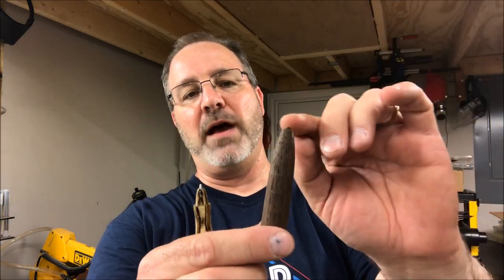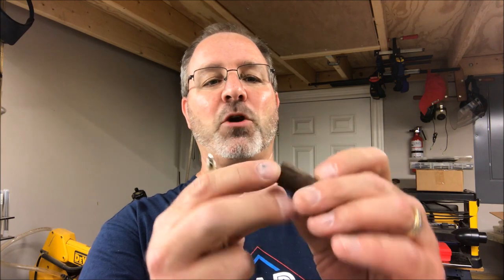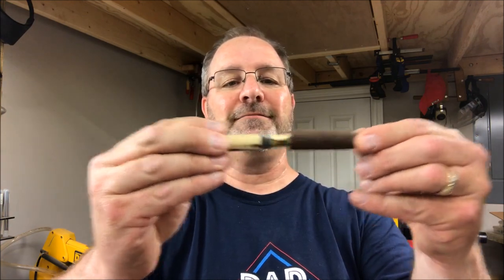Well, I had a great time in the shop today but I didn't quite accomplish what I set out to, so I'll be attempting this again at some point. Here's the cap I was working on — it's a little longer than I wanted. I had just parted the end off; you can see the nubbin on there. What happened is I had it on the mandrel and as I was parting it off, the parting tool bound between the cap and the piece I was removing. When it did, the cap stopped turning, the lathe kept turning, and it literally ripped the little acrylic inlay out of there. It was a very fine piece of acrylic I had put in as an inlay that allowed me to thread it, and now there's no threading at all.